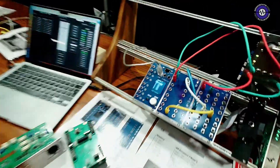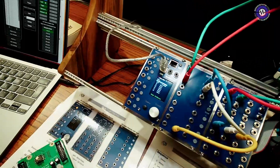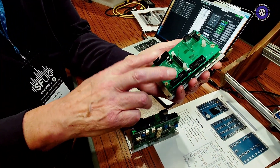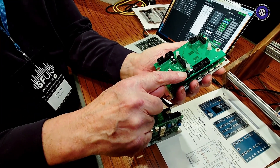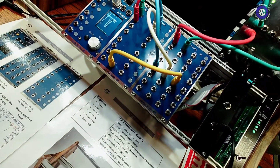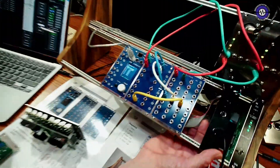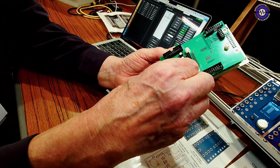So what's connecting the compute module to the IO — is there a bussing, or is the compute module controlling it? It is controlling. Essentially it's a ribbon cable bus — it takes the control signals, gets all the information, and takes the power, so you only have one power connection. There's a ribbon cable here and each one has a switch which sets the address.